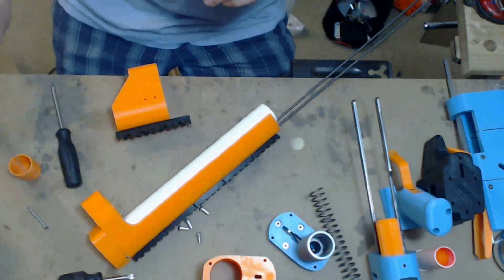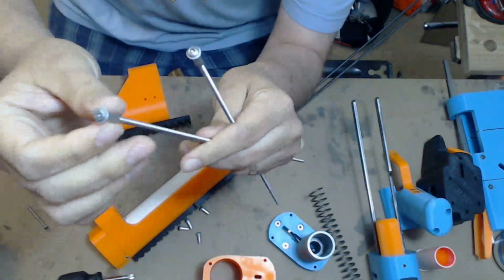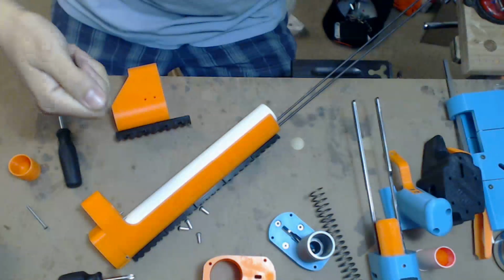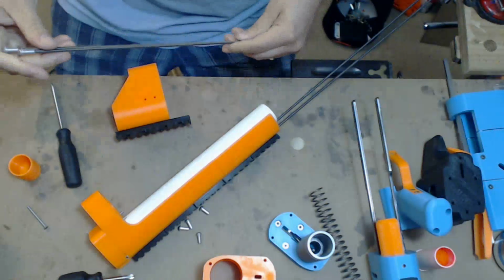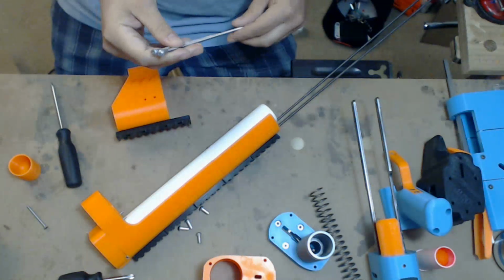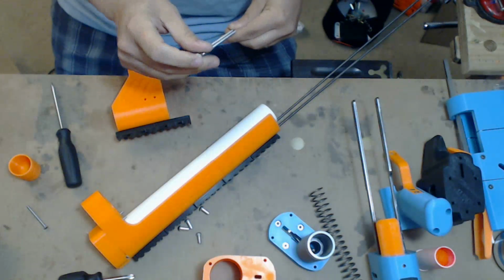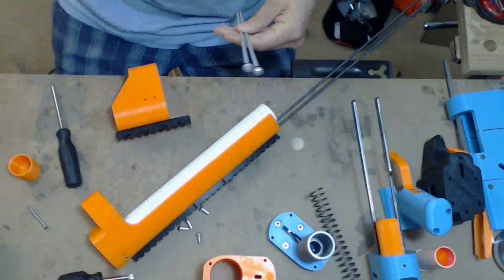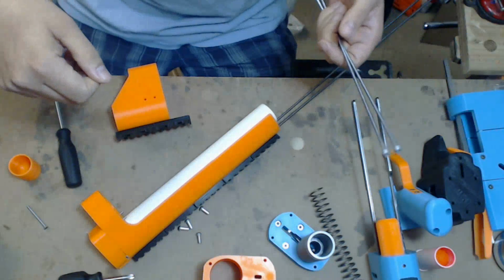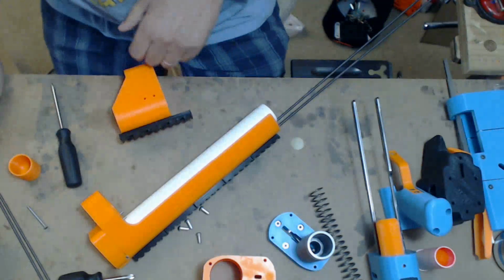When you do put this together the first time, though, when you screw these on, you'll want to make sure you don't screw them down all the way, and instead screw them equally from either end, because what ends up happening, at least I noticed at first, is that the threaded rod would not reach all the way to the other screws perfectly. So I found just screwing a little on each end would allow me to center the rods in there.